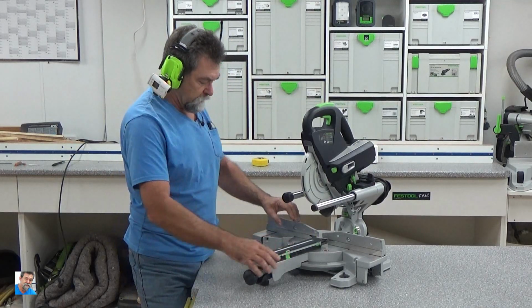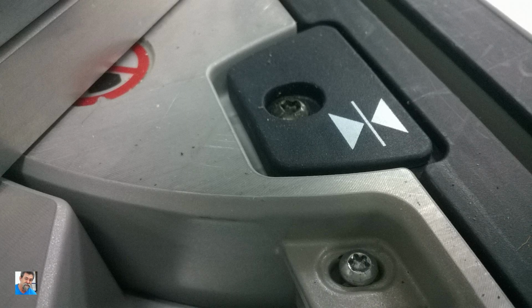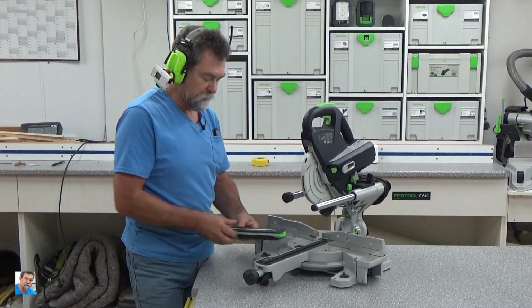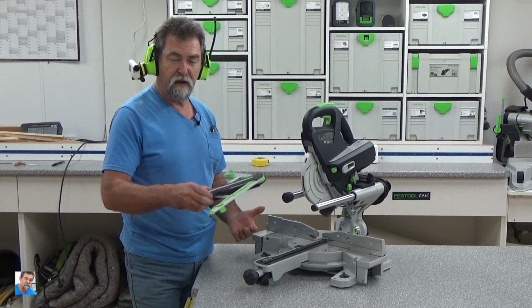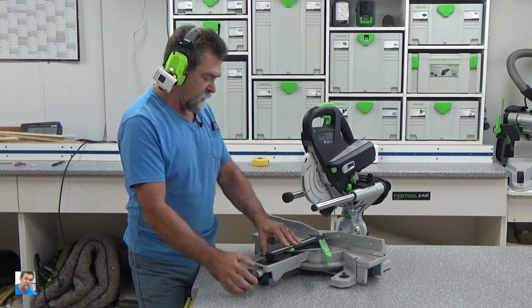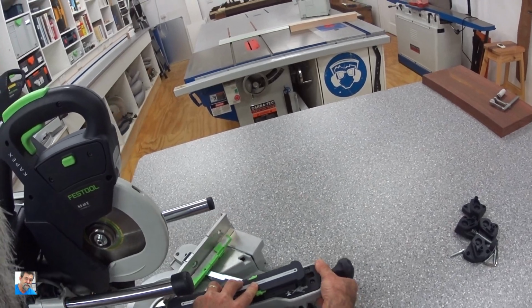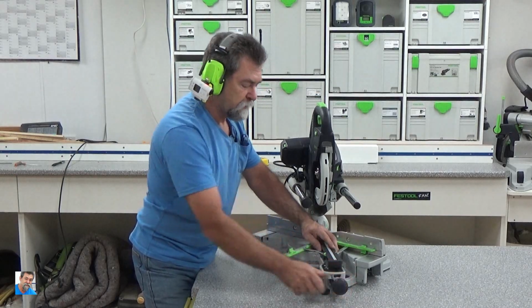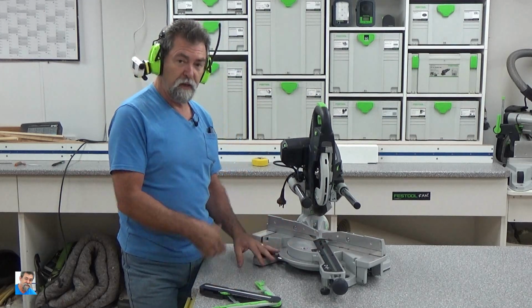Okay, so you'll see also on the divider there are some little arrows, and it can't be a big lip, because it would affect the quality of the cut. So it's only a shallow lip. You release the clamp and bring it out to wherever. I've gone through the angle divider in the 120s review, so this will be fine. I'll push it down to there, release this, and turn it around until it touches. That's it. And then it's a clamp situation. Now that's the angle that I needed from there. Away we go, we can cut.